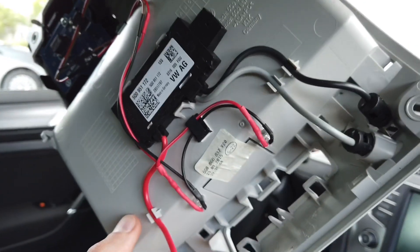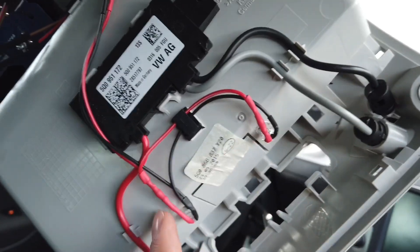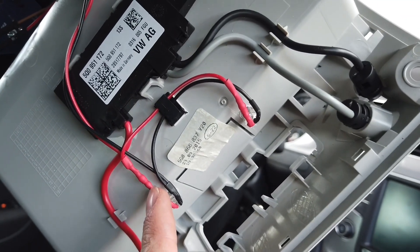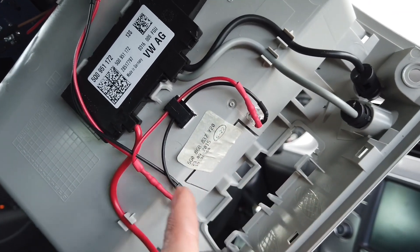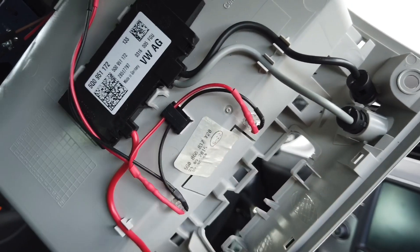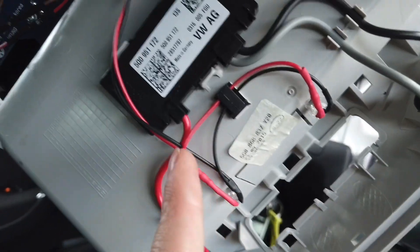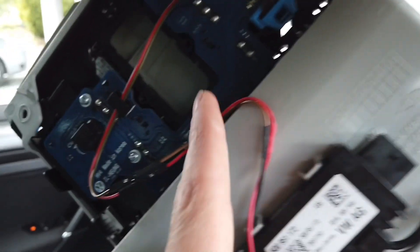Then wired it. I've used a 2k resistor on each LED just to limit the current flowing to the LED to make it a little bit dimmer and of course not to be damaged by the voltage, because it's connected to 12 volt. Then made some wiring over here.